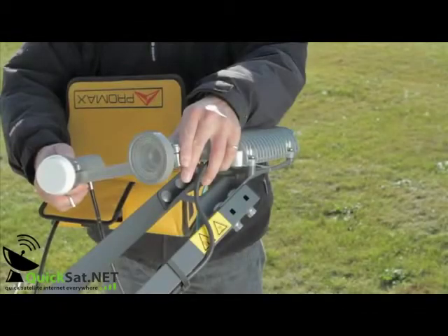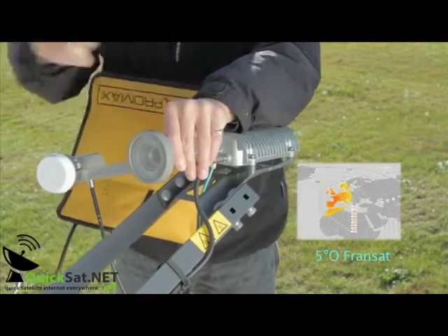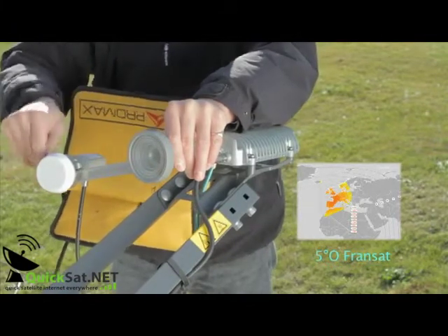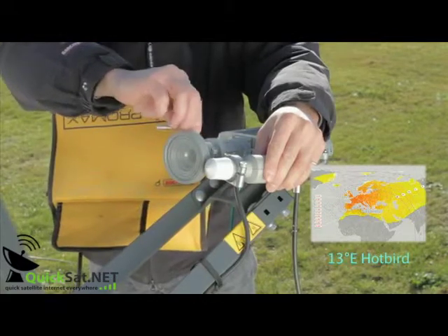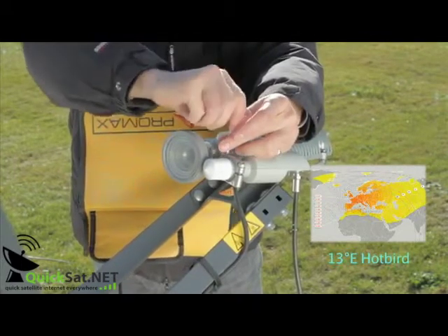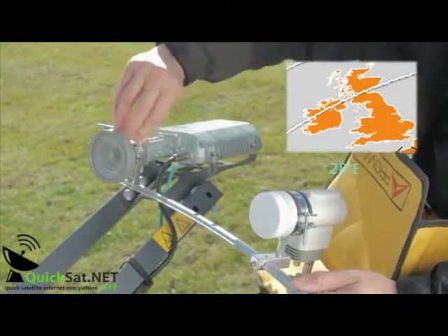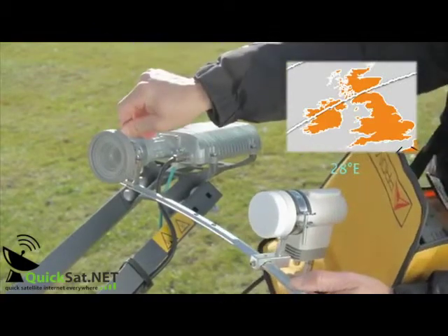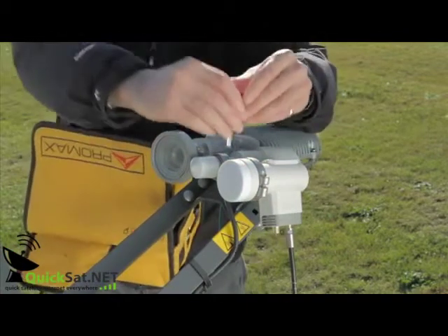The antenna will receive a large number of KU-band television satellites. There are a number of multi-feed supports available, though you will need an analyzer as the pointing and polarization needs to be precise. Positions include 5 degrees west for FRANSAT and TNT via satellite for France; 13 degrees east, the Hotbird position, for Western Europe; 28 degrees east for Freesat and Sky, available in the UK mainland. There is also a universal support that can be used for multiple satellite positions simultaneously, such as the 28 degrees east, 13 degrees east, and 19 degrees east positions for most Western European countries.